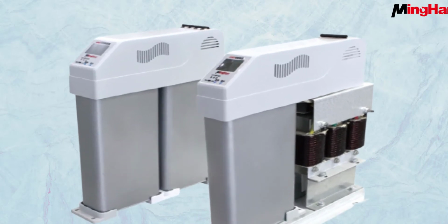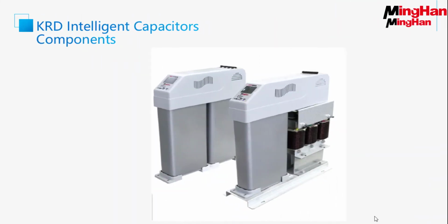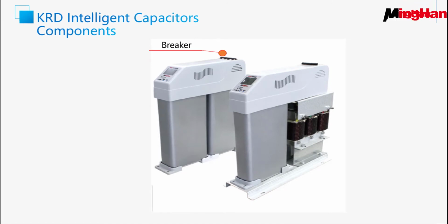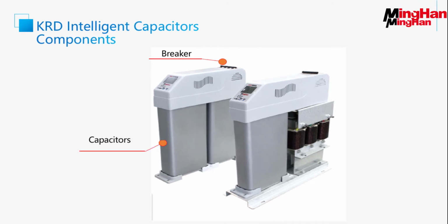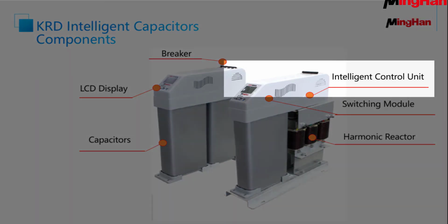KRD Smart Capacitor is new generation of low voltage power compensation devices. It is composed of different components. Miniature circuit breaker, which protects capacitor from overvoltage, short circuit, and overcurrent. Dry type capacitor. Harmonic reactor. An LCD display for parameters settings. Temperature sensor. Discharge resistor. Special switching module. And intelligent control unit. Intelligent control unit is the brain of this capacitor and has multiple roles.